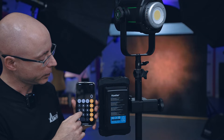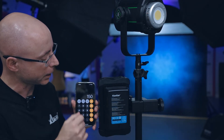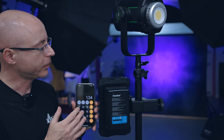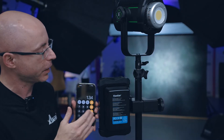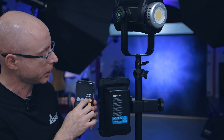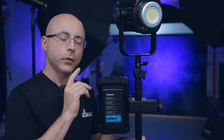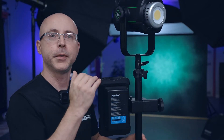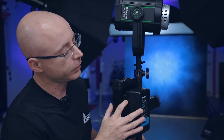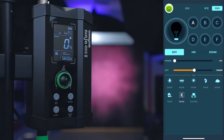In simple math: this battery is 201 watt-hours divided by the 150-watt light equals 1.34, which is about one hour and 18 minutes at 100%. At 50% — 201 divided by 75 — you get 2.68 hours. I recommend checking your gauge regularly; don't wait until the indicator starts flashing. When you see one bar without blinking, remove and replace the battery — draining it completely is never good for battery health.